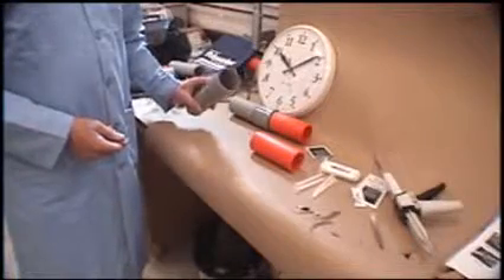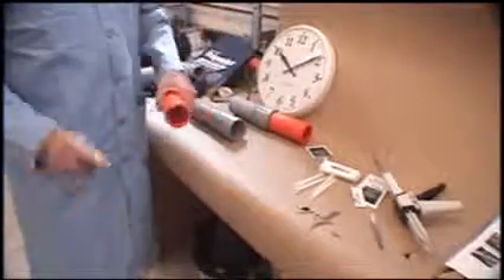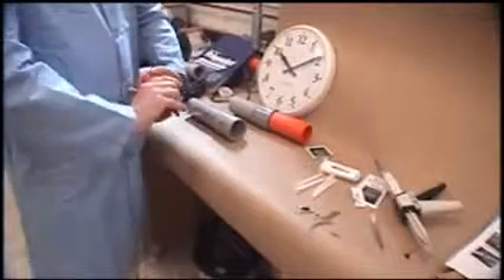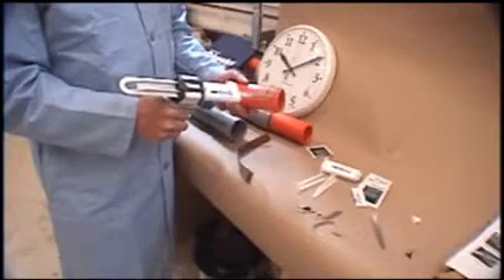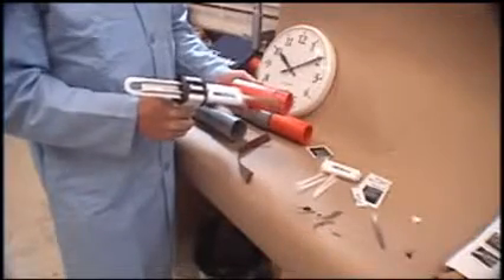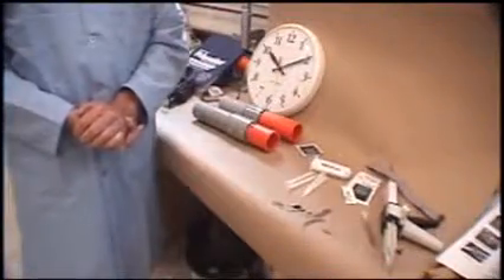You can also use the bell end of the PVC or a flared end — these actually make life a lot easier. All you need to do is rough out the inside of the bell end or flared end and sand the polyethylene. Now we're ready to apply the bonduit. The bonduit will last about four minutes before you have to throw away the tip, so you can use tips for more than one coupling if you get everything prepared ahead of time. Slide it in, twisting a little as you push. Make the ends smooth just to look nice. It's a lot quicker than the flared end.